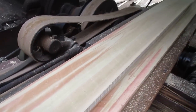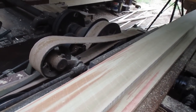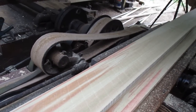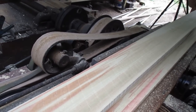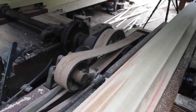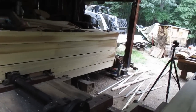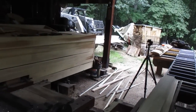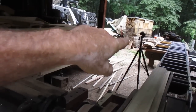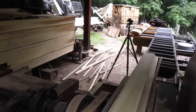These boards here are junk. But you know, when you're stickering boards, some of you probably have stickered some wood before. You always get to the top, you put your best ones on the bottom, and then you work your way up. And then you put your junkiest ones at the top. That's why you got a sticker stack, select, whatever order you do it in. And then as you get to the top, you need more weight. And I might take those pieces of pine slab out and put them in there.